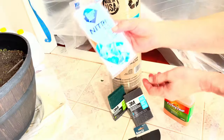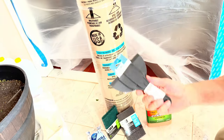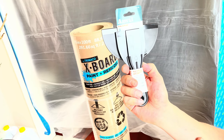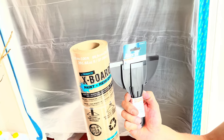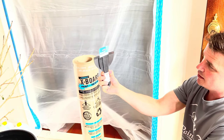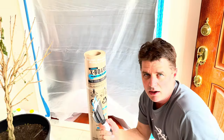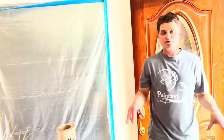We have gloves to protect your hands because the stripper will affect your skin. We also have a three-pack of Anvil plastic putty knives — we don't want to use metal ones because they might gouge or scratch the soft fiberglass surface. The pack includes an inch-and-a-half, a three-inch, and a six-inch, so we can work all parts of the door. I'm going to put down the floor protection first and then we'll come back to apply the stripper.